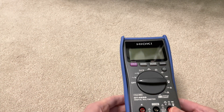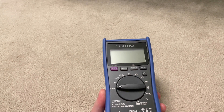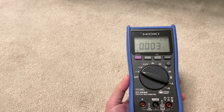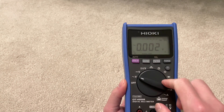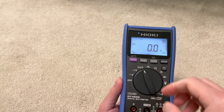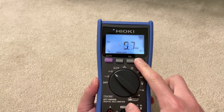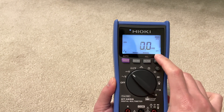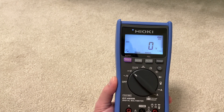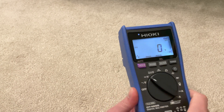This is a modern smart digital multimeter - it says it has firmware running on it, so there must be a CPU or logic controller inside. You can immediately select AC voltage, DC voltage, or automatic AC/DC detection. Let me turn on the backlight so you can see more clearly. It's set to auto-ranging, but you also have the option to do manual range selection: 600 millivolt range, 6 volts, 60 volts, up to 1000 volts DC.